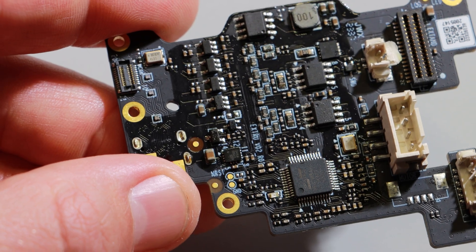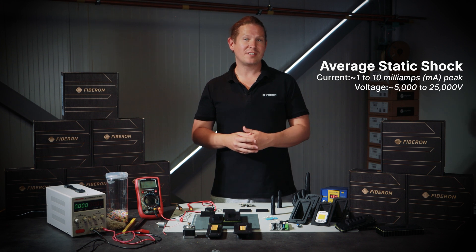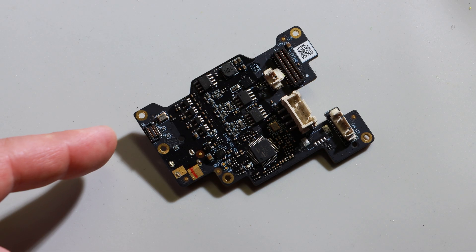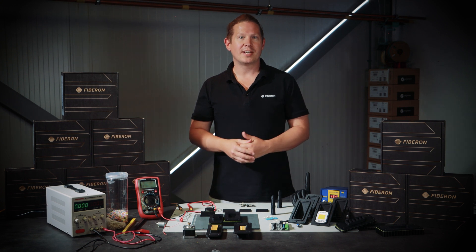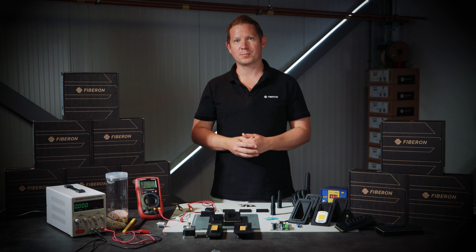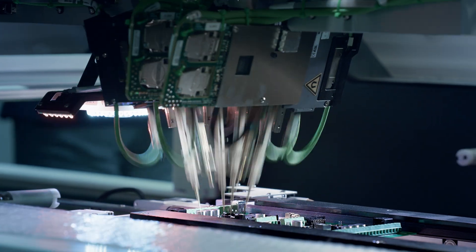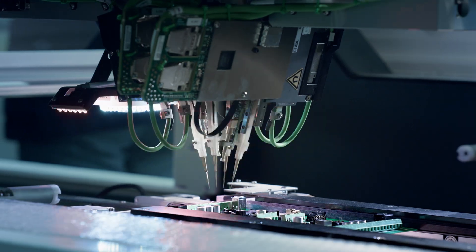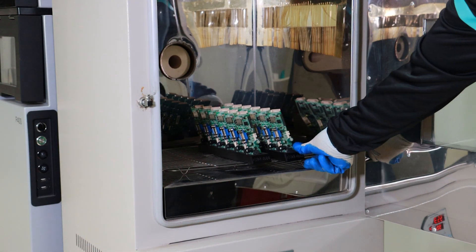Because while they are low in current, they're extremely high in voltage and have been measured at over 25,000 volts. If one of these static shocks finds its way onto a PCB board, it can fry the delicate components, rendering it useless or unfixable. This is why we use ESD safe materials when producing and handling electronic systems, as it offers a dissipative pathway for electrostatic charges to flow through.